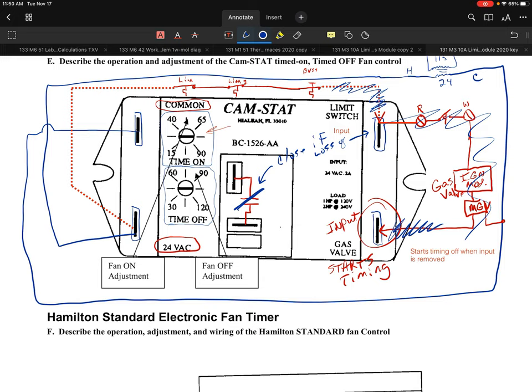In fact, a lot of those controls, to give you a little background on this, the manufacturers realized that the thermal sensing of those controls was not very good, and they weren't very effective. So what was going on is those old helical bimetal elements, some of those controls, the manufacturer would see that control not closing and getting the fan running soon enough.